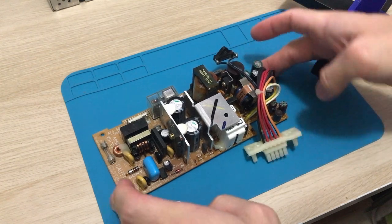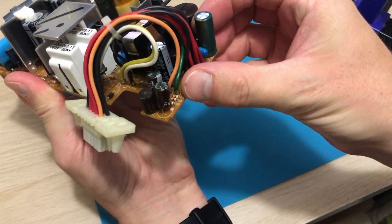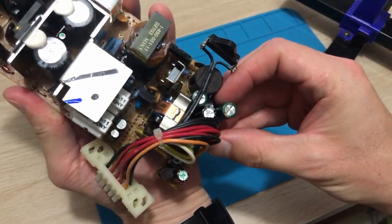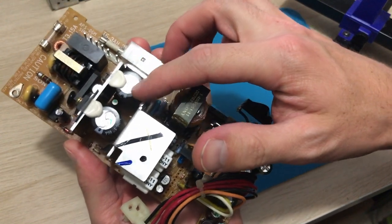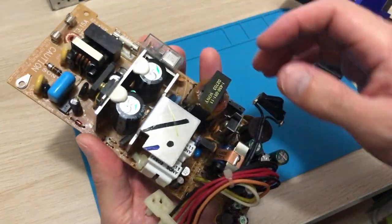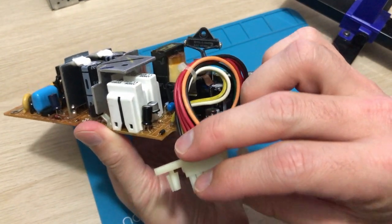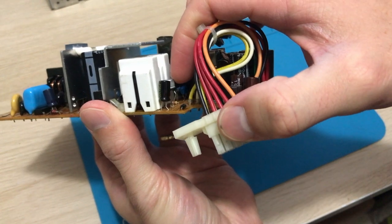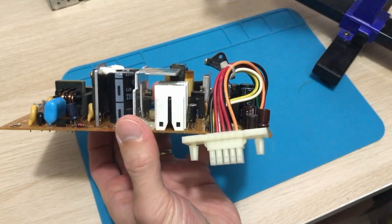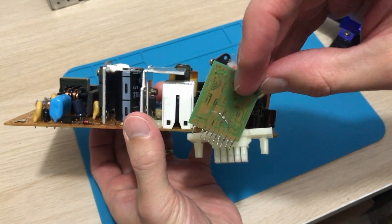I realized I actually have several caps that I'm lacking — not only the cap I made from an SMD cap, but all the ones marked with green except the big ones that I won't swap. I'll get a real through-hole cap for behind the daughter board while I'm at it, and of course we also have to solder the surface mount caps to the daughter board and get that fitted in there as well.